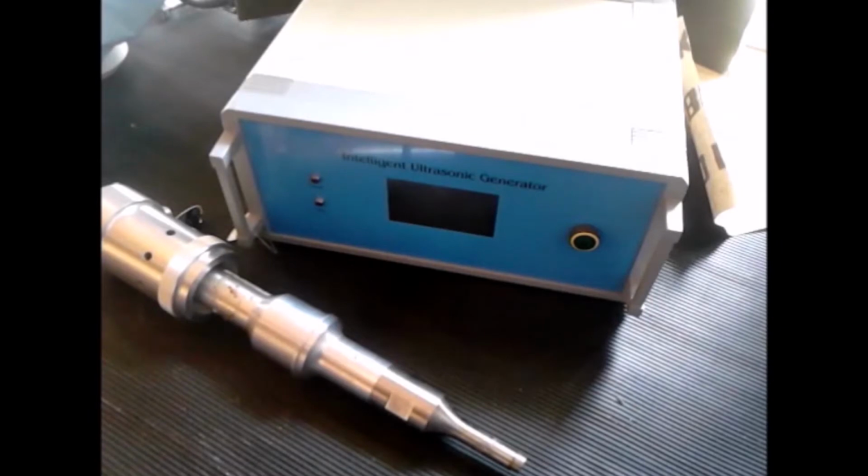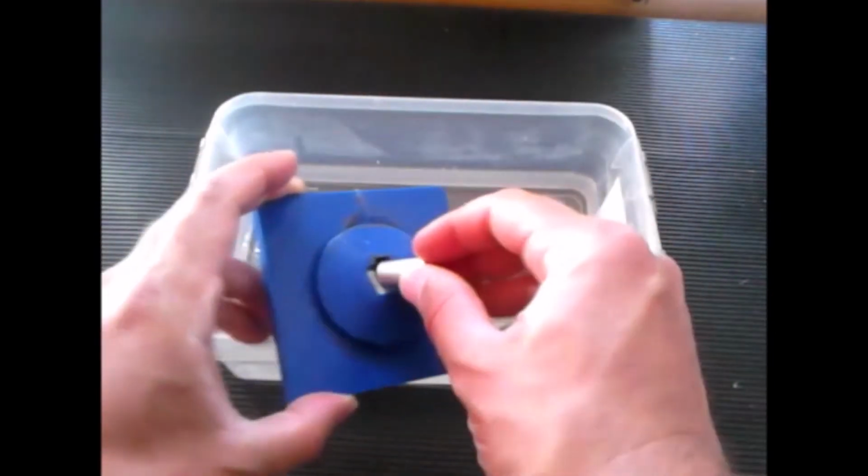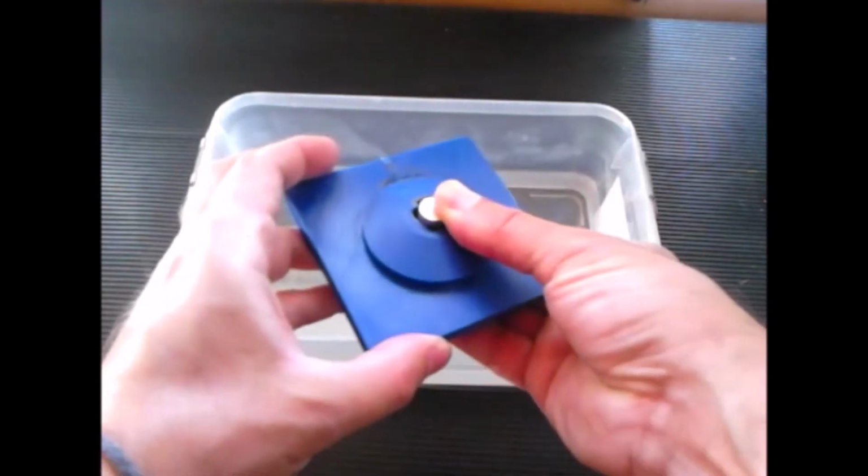After taking the data for the starting point of the final curve, we can go on and expose the sample to the cavitation erosion. We tried out different sonotrodes and ultrasound generators during the project. It finally turned out that a sonotrode with a 200 watt ultrasound generator worked best. The sonotrode has an exchangeable tip made of titanium alloy. The sample is fixed in the sample holder and put into the electrolyte.